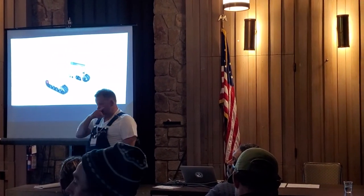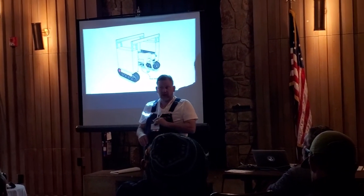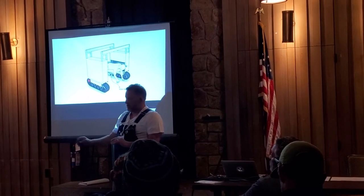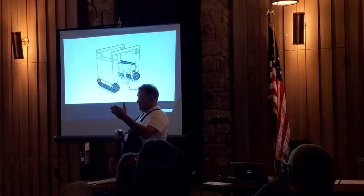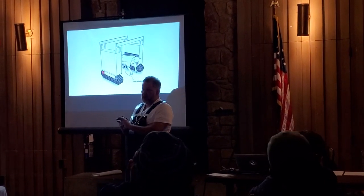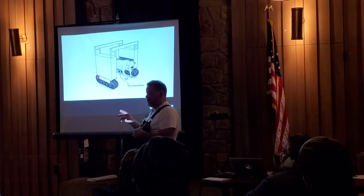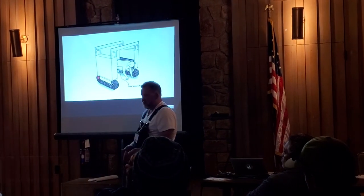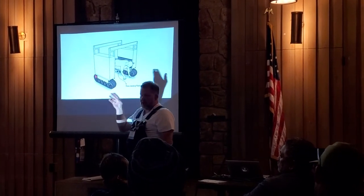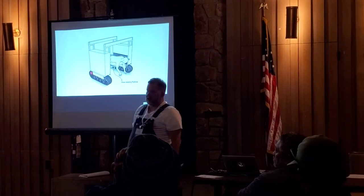Question: Would it be powerful enough to run a flail mower? I think so. My plan is to have a BCS attachment. I'm not going to make a flail mower — Farmer Friend makes a great quick greens harvester and we're going to try to work together to make one to fit this. Lots of people already own a flail mower and probably don't want to buy a special one. So we're making a PTO attachment — a direct drive DC motor like from a forklift — that will run your flail mower. If you're using a seed drill digging deep into the soil, that will drain the battery faster. But if you're just going up and down rows, it'll run all day. Once you engage into the soil it drags down the battery, but if you're charging at the same time, it should go a good long while.